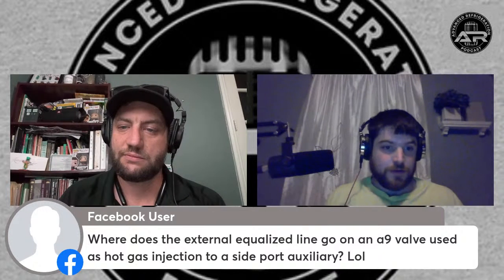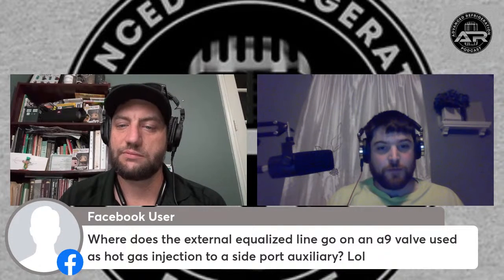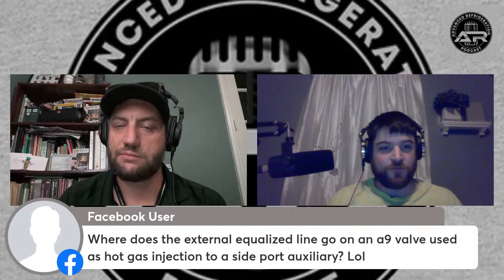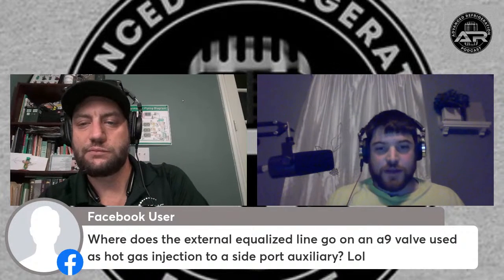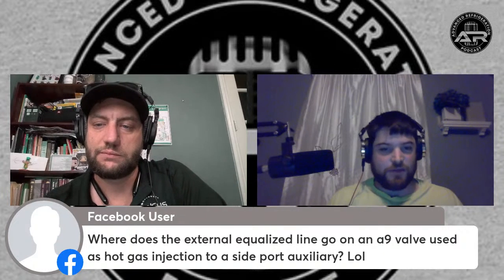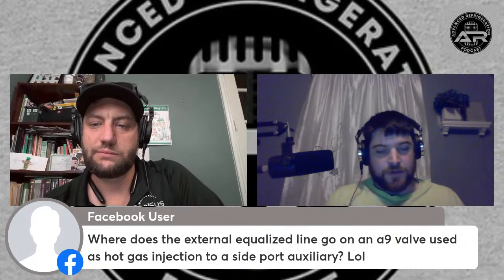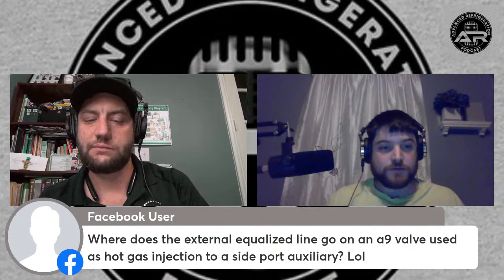So, the Walmart ones I really haven't seen too many issues with. Most of it's been, unfortunately, the electricians suck. Yeah. Usually it's stuff like that, or sensors getting put in the wrong spots, or sensors crisscrossed, EEVs crisscrossed. That's been a big one, making sure the EEVs are going to the right coils.